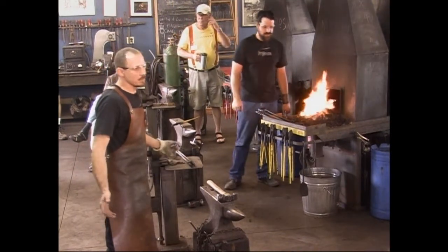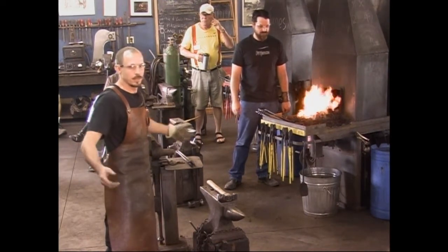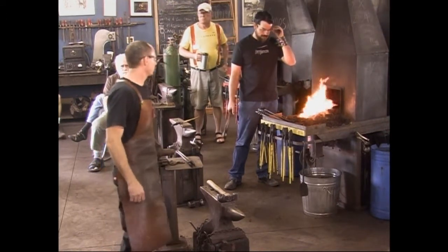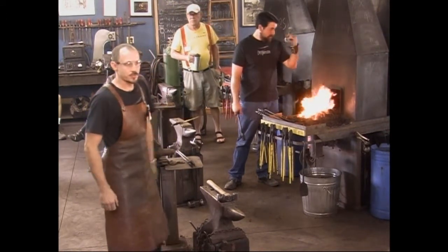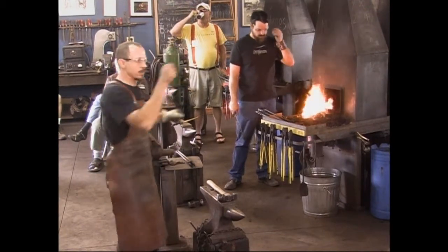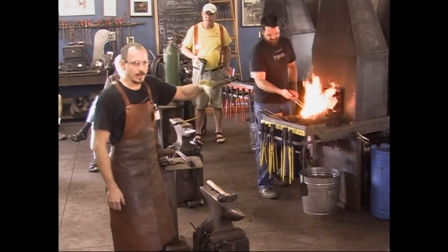500 degrees minimum. You can do that in a kitchen oven. Doesn't take time if it can just sit while you're doing something else. Kitchen oven, or get your forge if you have a gas forge. Get it nice and hot, shut it off, give it a moment, set the piece in there, walk off. Let it heat slowly without any gas on.